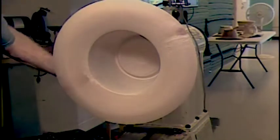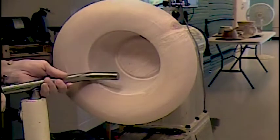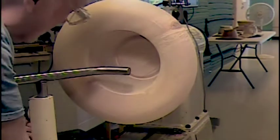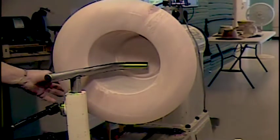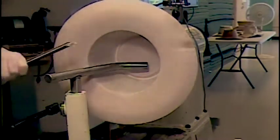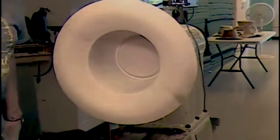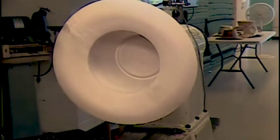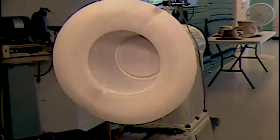So every one of my hats has a spiral cut. I'm going to do that now before I do the 220 grit. Up in the top, a little circle and a spiral at a very low speed. Circle. Get it? So then we go in reverse again, because then, for the same reason, I can see if I'm done with that grit, if I see any of the scratches going the other way.